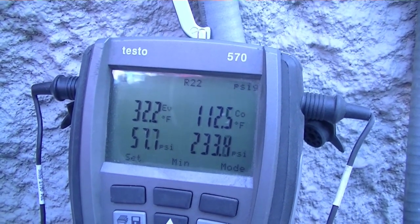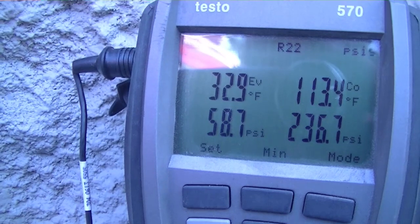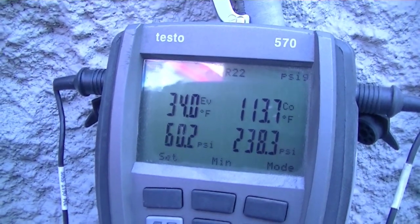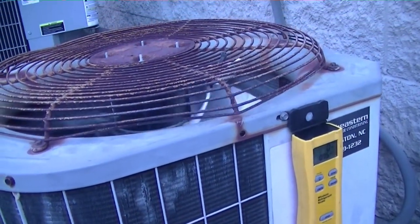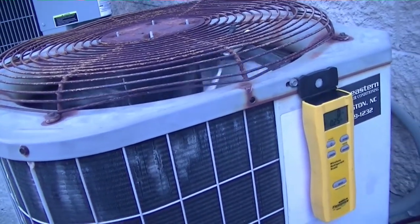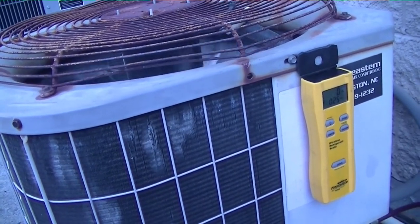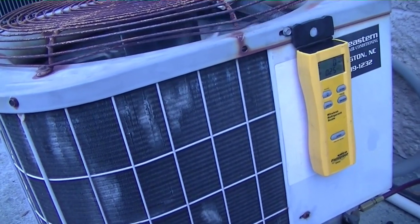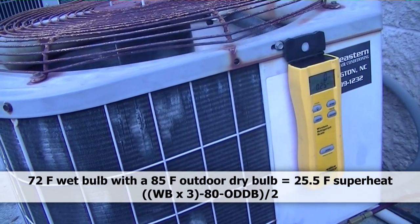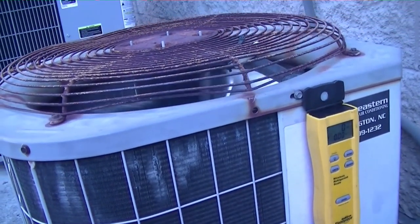The pressure's been fluctuating between about 228 up to around 240 and back, and our suction pressure is down there in the 55 to 60 range, freezing a little bit lower. So we'll let it run for a little while and add a little bit of refrigerant, and hopefully it'll be a lot better off than before. Now that we have the airflow a whole lot better — it's still not coming out the top, more out the side, but a whole lot better than before — we're running 230 over 58 with a superheat right around 50 to 55, fluctuating. We're going to take it down to around 25. I can't go inside, but I know that's going to be real close to our reading inside. It's just a guesstimate, not scientific, but it should be close, and I can fine-tune it from there if necessary. We'll go ahead and put the refrigerant in and see how she runs.